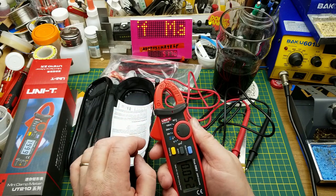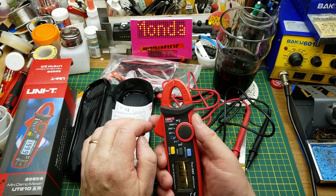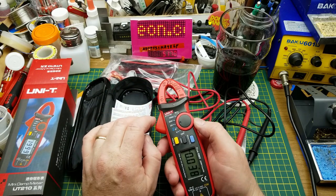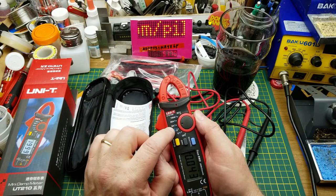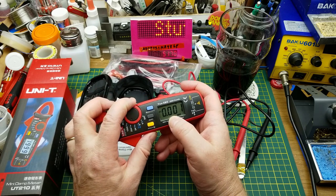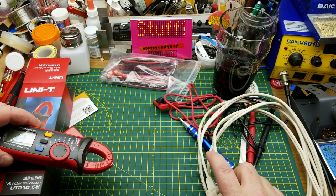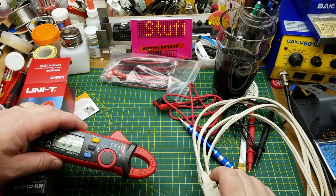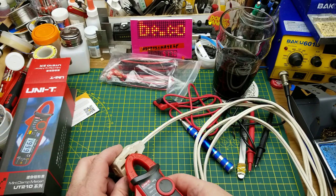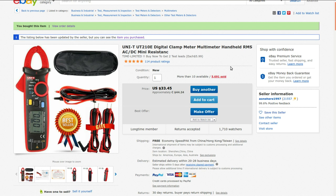It's got a positive on one side and negative on the other so you can measure current flow in either direction and know which way it's going. That's nice — if you've got that clamped onto the lead between a power system and a battery, you can tell whether the battery is being charged or discharged. Multiple ranges too: two amp, 20 amp, and 100 amp range. And there's a non-contact voltage detector — it can sense live voltage about three or four centimeters out and chirps at you when you get right on top of it.